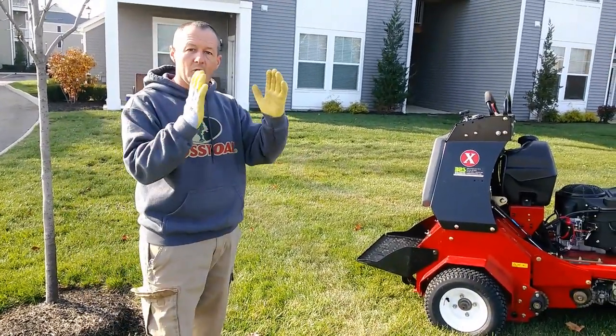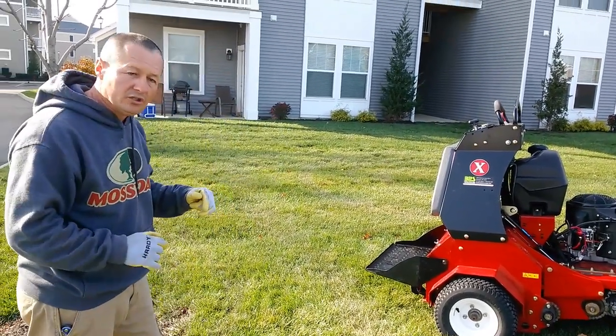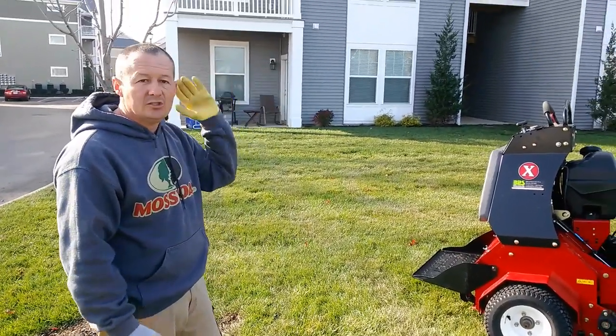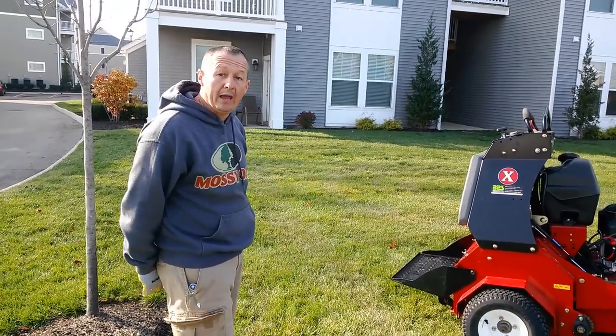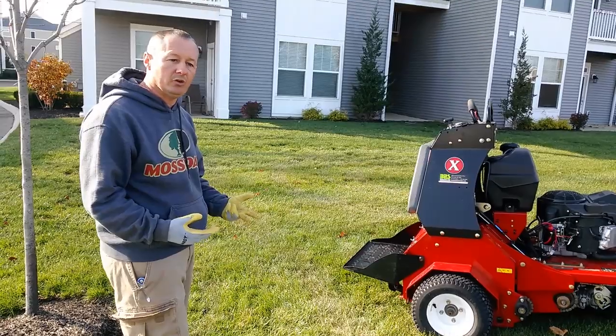It'll want to put a lot of horizontal tension on the tines. It will also tear the ground up when you do that. So generally, you want to run as much straight lines as possible. Slow sweeping curves are okay, but nothing too sharp without letting the tines up off the ground.